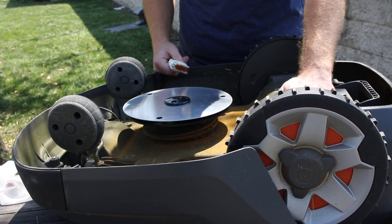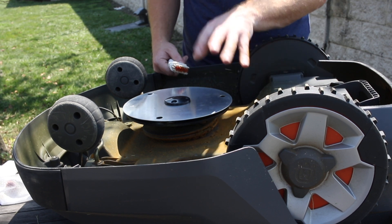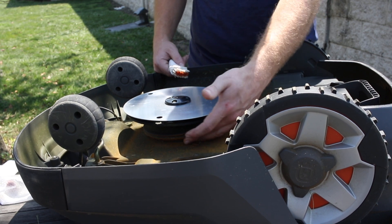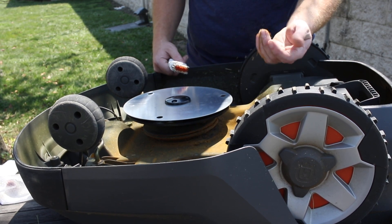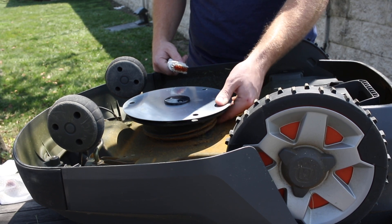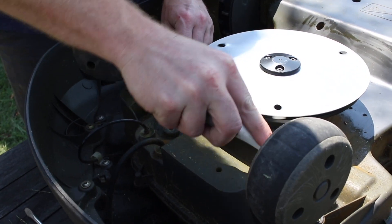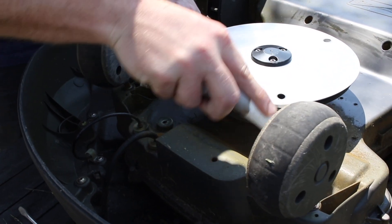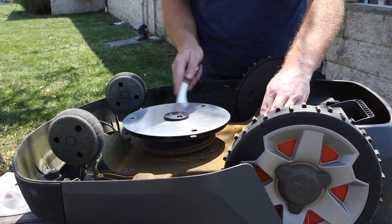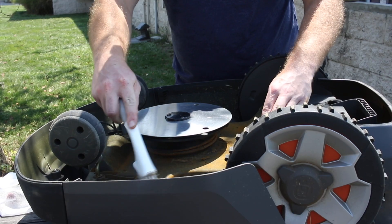This one is pretty clean, but if yours is rather dirty you're going to notice some grass buildup, especially underneath the blade — which is a little difficult to see — but even this mower has some debris. There is a boot in here so be careful when you are cleaning it, as not to tear that. I have a small, softer bristle brush so you can get in there and if you have backed-up grass you just kind of want to scrub over it and clean all the cracks and crevices.